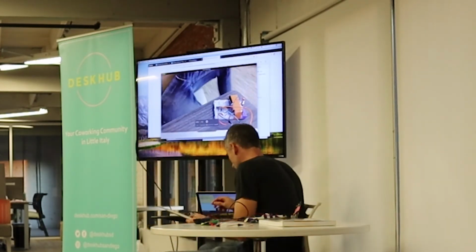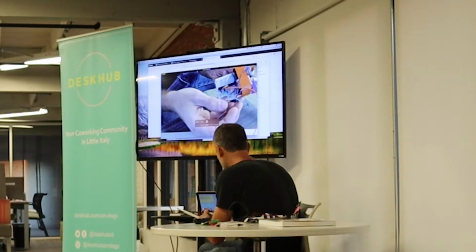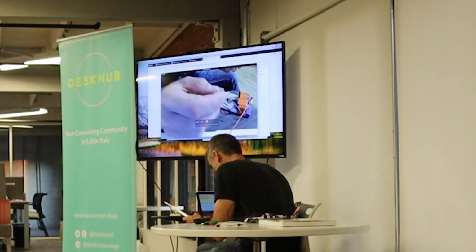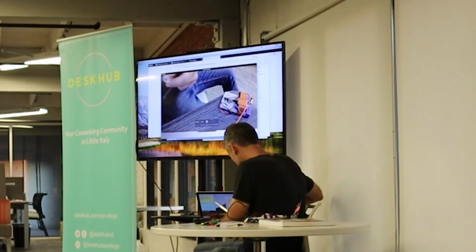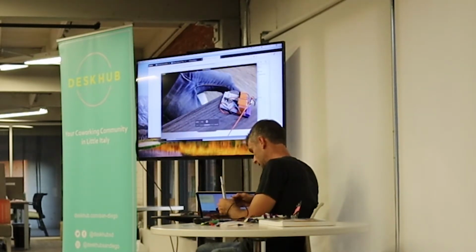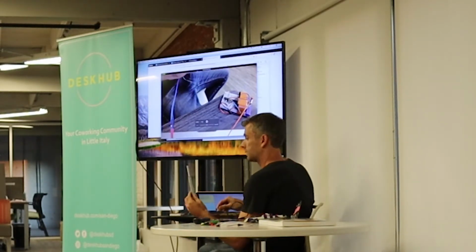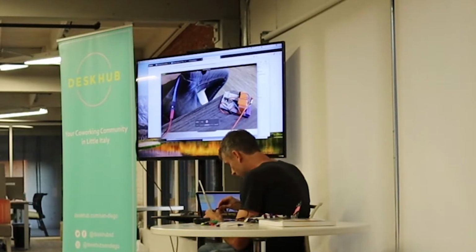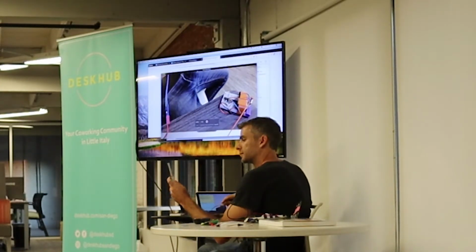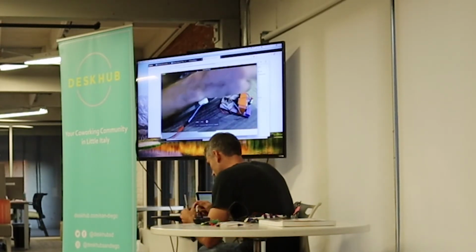So, real quick, I'm going to show you this linear actuator. And here you can see my 9-volt battery, and then this is my power switch. So if I turn that thing on, let me actually show you this guy. Using something that I plugged into the wall to cheat for a second, if we plug this into the power, you get a linear actuator spinning probably clockwise, and it's pushing this piston out. Now, if I switch the orientation and just swap which pin is in, then it retracts slowly.